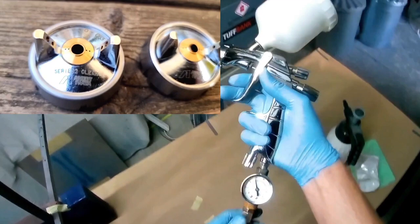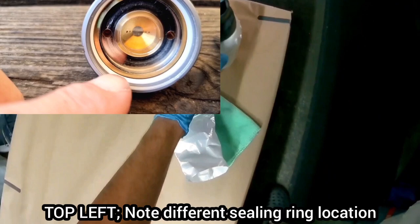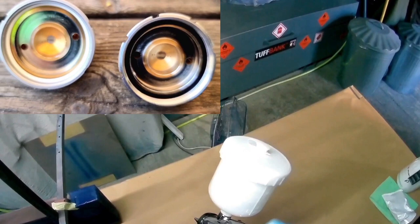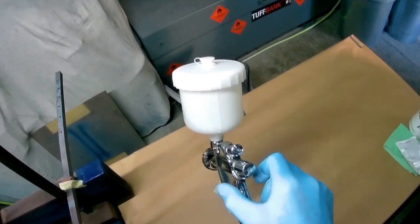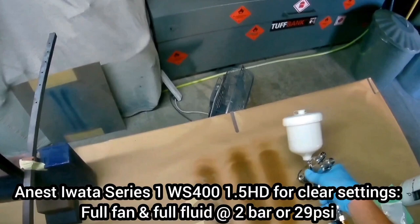I went through a series of videos to get to where I am today, and it turned out I hadn't done the tip up tight enough to get the correct angle. There's a split tip on these guns — a four-split tip — and what you need on the Series 2 to get it to spray properly is one slit at 12 o'clock, one at 3 o'clock, one at 6 o'clock, and one at 9 o'clock. The slits at 9 o'clock and 3 o'clock need to be opposite the air horns with the air holes so the gun can draw the fluid out. If you don't get it like that, it splits the pattern just as the old one did.